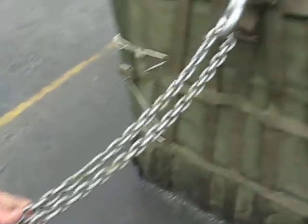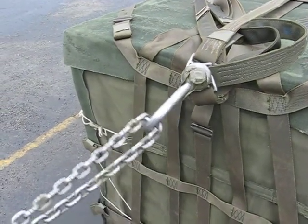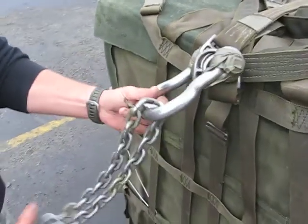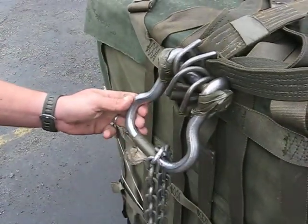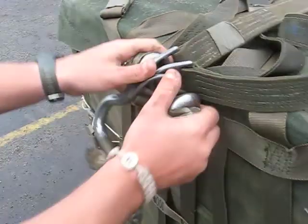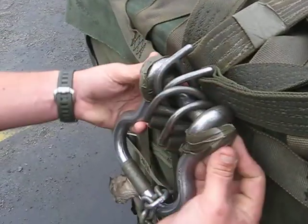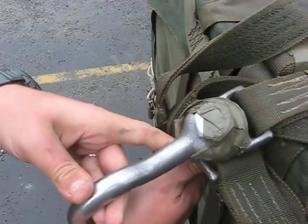Next, you're going to move on to your lifting chain. Make sure that it's routed once, and once only, through your medium clevis. The medium clevis is used as the primary lifting point on this load — no other clevis. It has a rated capacity of 6,250 pounds. When you pick up your clevis, you need to pick it up by the nuts. You need to ensure that the nuts are present, hand tight, and secured with a piece of two-inch tape on either side.